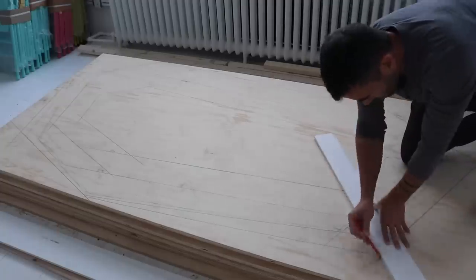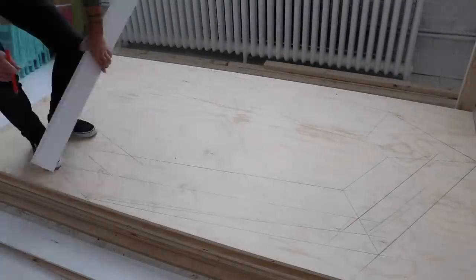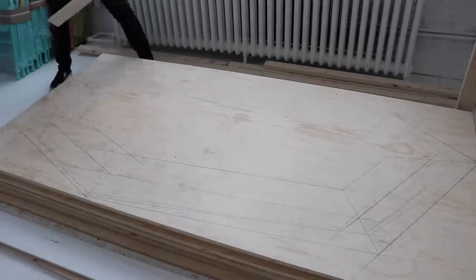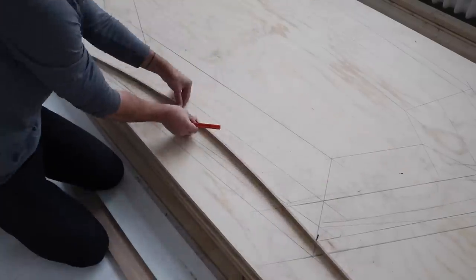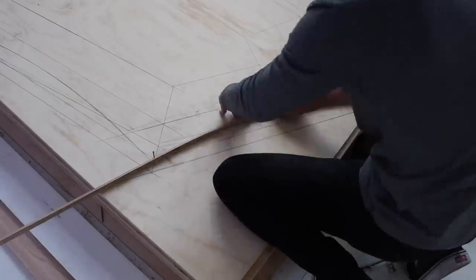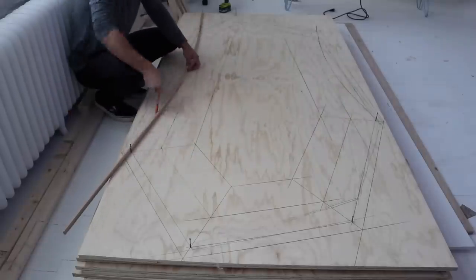The design process is actually quite simple. I just have to come up with the profile for one of the top pieces and the bottom pieces and then I can use those pieces as templates to draw the pieces in between. I don't want the facets to be straight — instead I'm going for a sort of scalloped curve. To draw these lines I cut a thin piece of plywood, screwed in some finish screws, and then traced along the bend in the plywood.